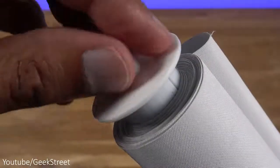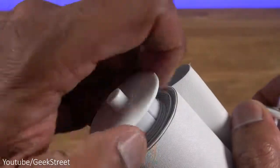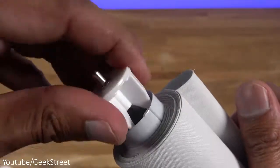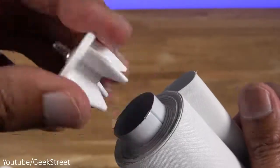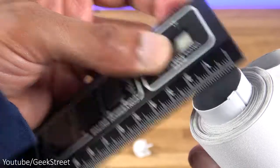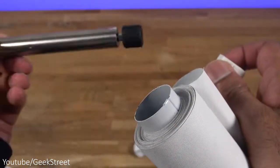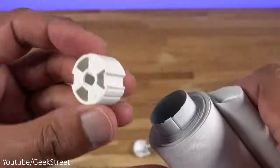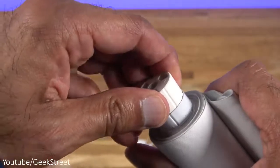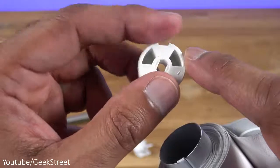With the blind removed, there's an end cap with an adapter already on it. They say it should fit into blinds up to two and a half centimeters, and you can see this one measures two and a half centimeters in diameter. The adapter should grip into the area quite firmly, though it can be a tight squeeze. If you do struggle, you can slice a little bit off — sand it down or carefully cut it with a knife or chisel.